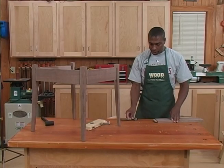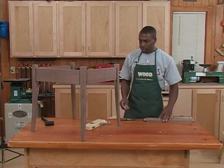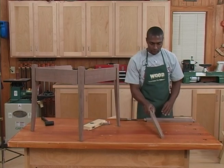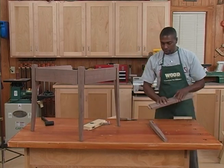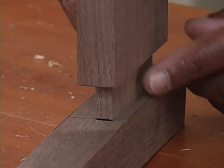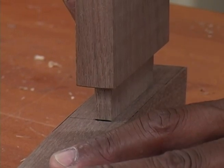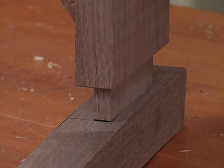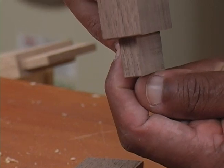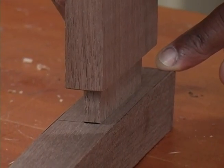The final step to getting that just-so fit between the mortise and the tenon is where the shoulder plane really earns its keep. What I've got left on my little side table is one more joint where we're going to fit this tenon into that mortise. As you can see, our tenon as it came off the machines is slightly too thick and slightly too wide to fit into its intended mortise. We just have to remove a few thousandths of an inch of material from this cheek, a few thousandths from this cheek, and perhaps a little bit from the short edges to get that just-so fit between these two parts.